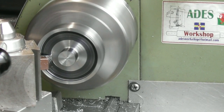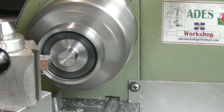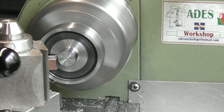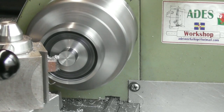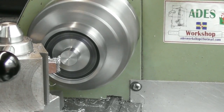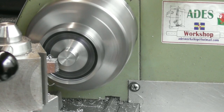So, where am I? I can go a little further. I'm watching the bottom of the tool. About there. About the 8mm mark on my DRO. So I'm just going to go in now, the final. There, that's 11mm on my DRO. And back in, to my 0. So I'm going to take a little cut off this diameter, maybe 0.1 a side, just to see an actual figure where I am. Here we go, this is cleaning up now.